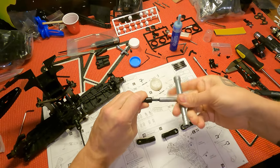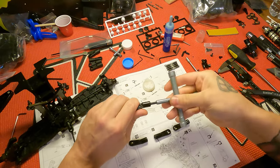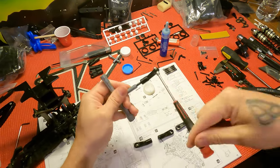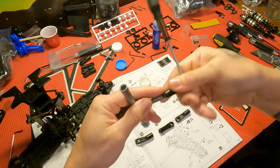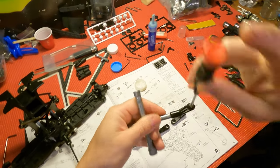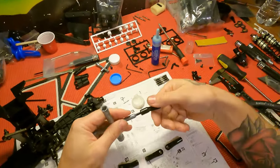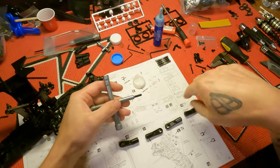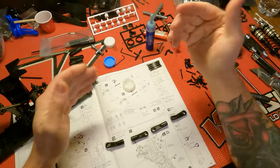We're still going to the left because we're on the reverse thread. Make sure she's staying straight. It can get a little tricky when you switch sides — you still go to the left. You might be wondering why you're taking the headache of threading all these in — I'll explain in just a second. Make sure you're actually loosening it because you can tighten it and bust the end of these things. So this is basically just a tap — move it out of the way so now you can build your turnbuckles for real.